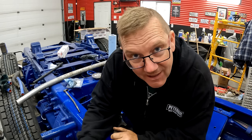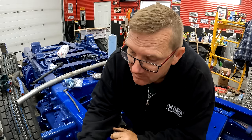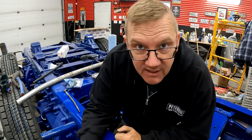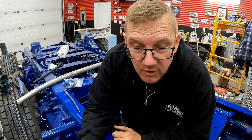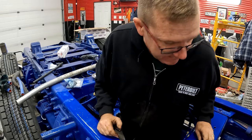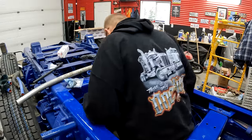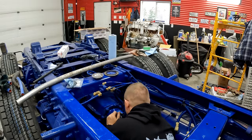And I found online that you need to torque it to 880 to 1,000 foot-pounds of torque. Now, I have a torque wrench that goes to 500, and it's got a bar about that long. So I think if I use the pipe again and give it a couple good ooga-doogas, that should be about the same as 1,500 foot-pounds of torque, because gun show! No, but seriously, I think a bit of a bar pull, about 6 feet, should work. You know, like that much. So, let's tighten this up. Righty tighty, lefty loosey.